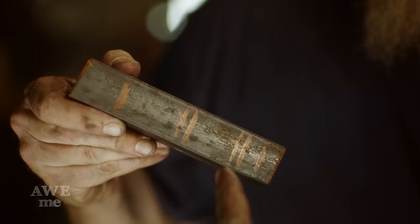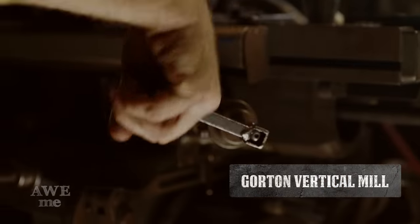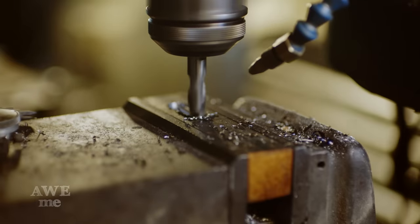On the Silent Hill blade, we've got a really big knife — it kind of has a bolster more than a guard. It's kind of a big block of steel that goes on there, so we've got to make a pretty big slot in this. We're gonna put it on the milling machine, slot where it goes all the way through for the tang, and then slot a shoulder that the rest of the blade can lock into to give it some strength.